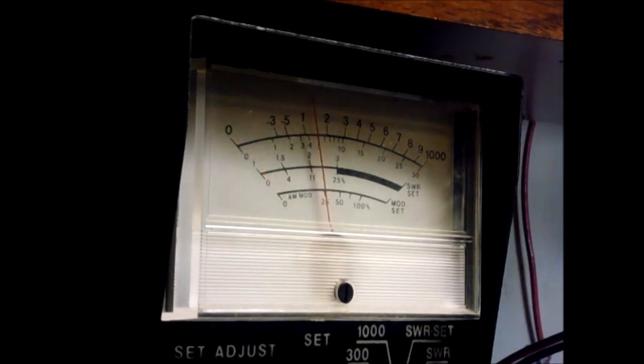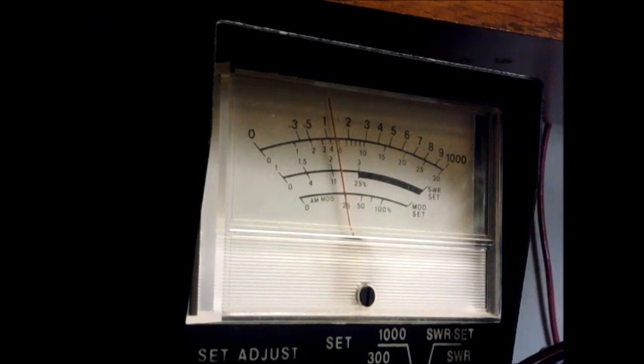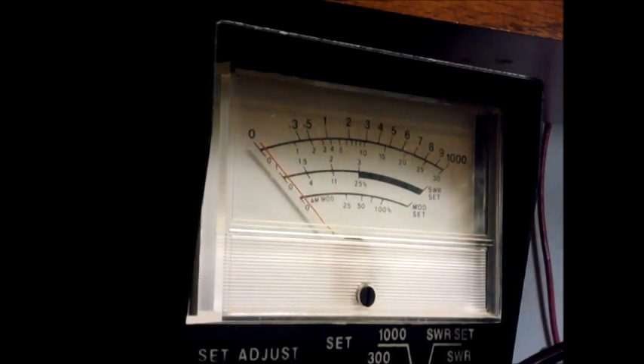All right, that's what we're slammed in for input. There's our input — 55 watts. And that's how much power we're putting out — same result as I got with the other one. About 15 watts. So instead of amplifying, it's doing the opposite. Sir, your 572Bs are flat. That's three of your 572Bs tested in my Ameritron. It was easily doing 450 dead key, 550 swing with 55 watts of input.